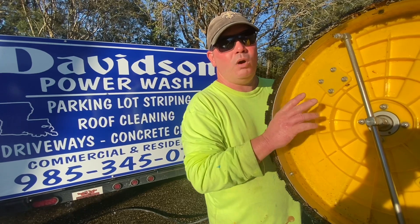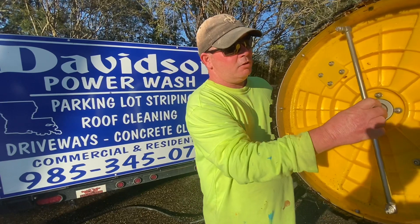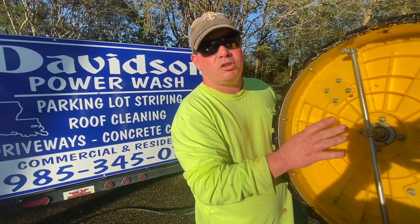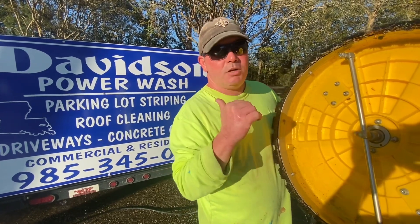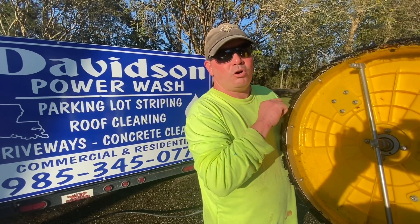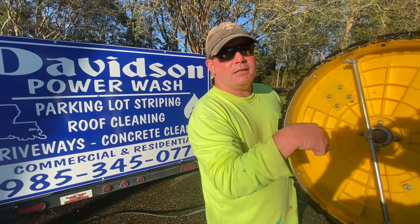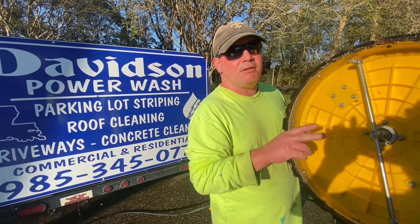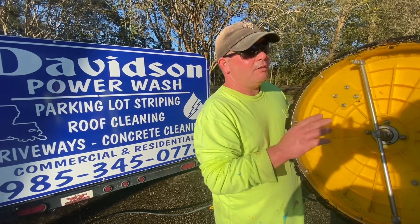So we want to know how to fix these and what makes them do that. A surface cleaner is exactly what it is — it cleans a surface. We clean surfaces with high pressure using a pressure washer mounted on this trailer. It powers water through a hose, through a gun assembly and down to this swivel here, causing it to turn really fast and clean the concrete. It's basically like having two pressure washing guns spinning under here for you.